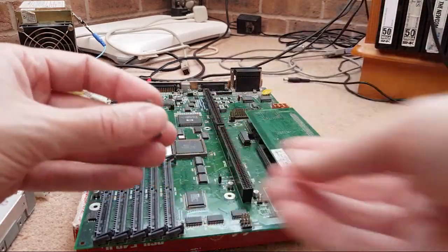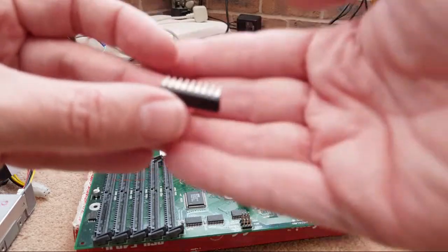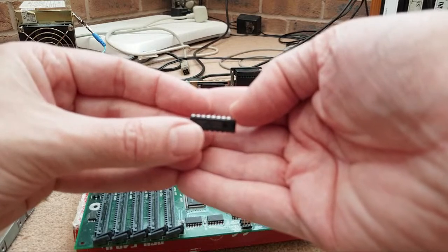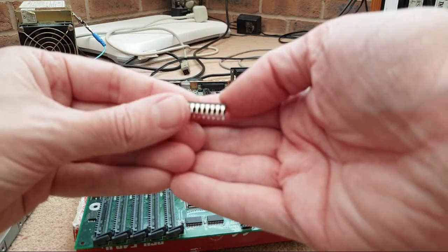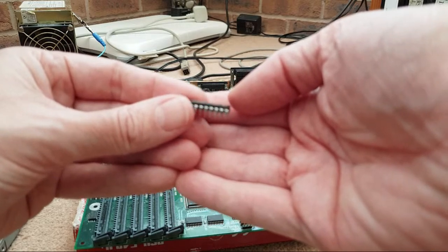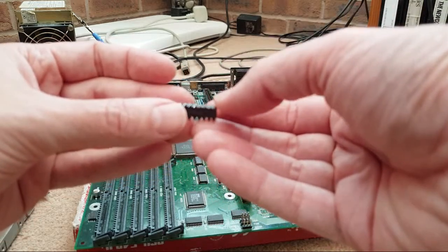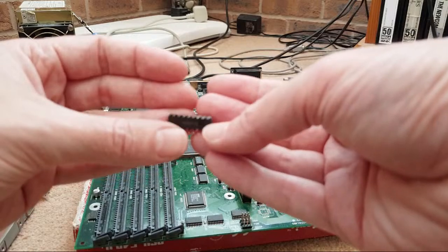I'm sure there is. Something to point out, actually, I can see that straight away. I don't know whether you'll be able to tell, they're kind of covered in solder. These are described as new, but they're no way new. They've been covered in solder there. That's not what you would expect, it wouldn't look like that. That looks super shiny, glossy, like someone took it off an old board.